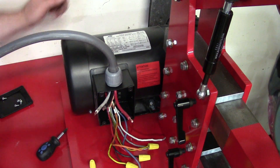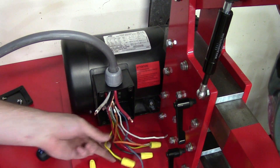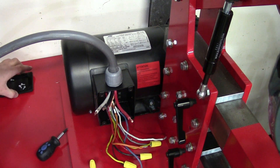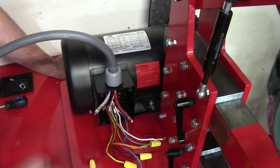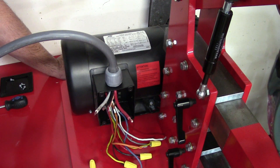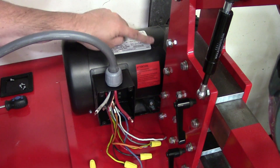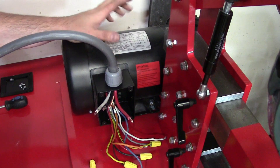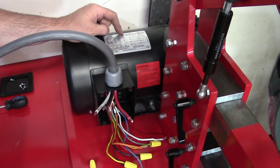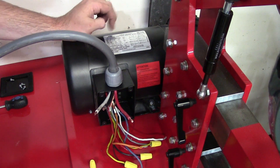In this video we're going to cover how to hook your three-phase motor to your VFD. When you open up this cover it makes you want to run for the hills if you're not very electrically savvy, but we're going to walk you through this step by step and it's going to be real easy. The most important thing is the nameplate on your motor. If it's an old or used motor without a nameplate, you're going to have to find it, look it up, or call an electrician.